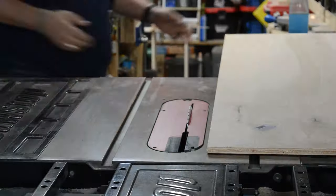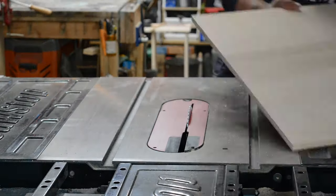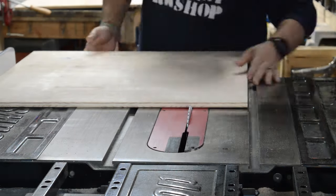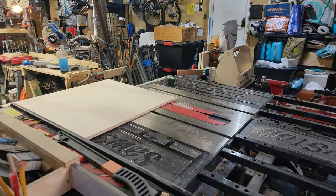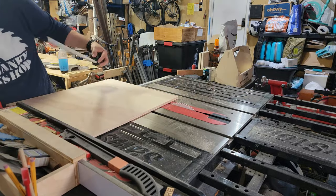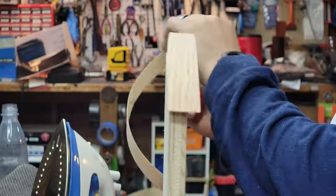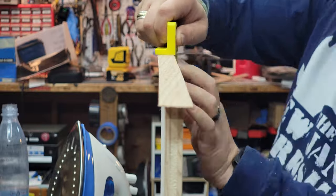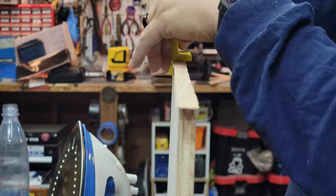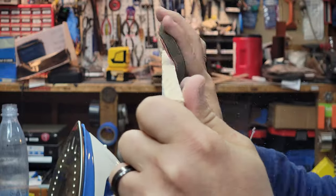Now I'm starting to cut the door. I originally made one that was three-quarter inch but needed to go with half-inch, so I'm using half-inch plywood for the front door, sizing it up, and making sure I have the right dimensions even though my fence on the SawStop is very accurate. On the front door I'm putting on some edge banding along with some cat hair filler to get it fitted nice and smooth. It doesn't need the rigidity that the actual carcass does, but it cleans up really nicely after a little sanding.